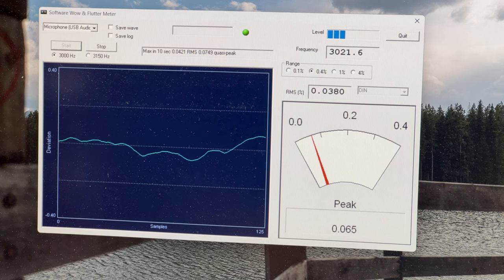And to make things further easier for myself, I had to desolder these two wire wrap posts, and also there's one over here, number 7. And yeah, there's not enough slack on those wires in order to get the board to this point otherwise, so I just decided to go ahead and desolder those and pull them out and not bother with the wire wrap at all. So yeah, I should be able to get in here and replace the rest of the capacitors now, and also get at these switches here to clean them, but it wasn't fun getting to this point, I'll tell you what.